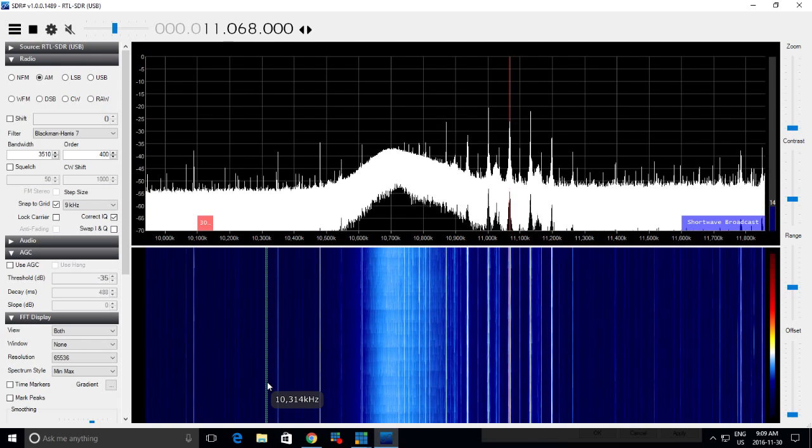Okay, so that's really good, and that's really bad, and that's really bad. So what do I mean by that? Well, first, it's really good. I can certainly see the IF peak right around 10.7. That's good. Looks like the way I've got things connected, I can see something.